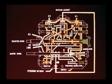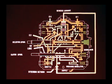Although the C2 pilot is operated, the C2 clutch does not engage immediately because of the limited flow and pressure available. Oil passing through the supply circuit restrictor is directed into the gallery that supplies the C2 clutch. The restrictor limits the flow volume, and the modulator ball and spring in the end of the clutch spool limits the pressure in the C2 supply gallery. As the spool is moved further to the right, the modulator spring tension increases, and a corresponding increase in C2 clutch pressure occurs. The control of flow and pressure in the C2 clutch supply circuit permits controlled or feathered engagement of the C2 clutch, offering a smooth start in vehicle travel.